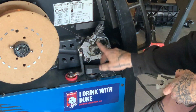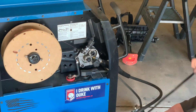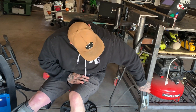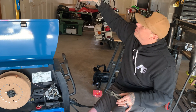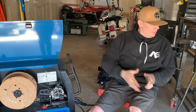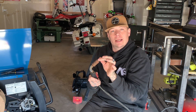This is how I get my tension from my drive rollers, and I have my wire guide that feeds my wire into my whip. My cable comes out, and I talked about the ground that's hooked up to my negative terminal. This is a medium-duty ground for where you're welding. This is the first thing that needs to get connected — this is what connects our power to make that loop. This thing's going to be energized. I've got power coming from the power line into the breaker box, running into the wall outlet into the machine.